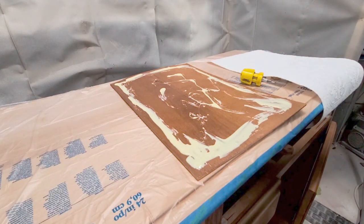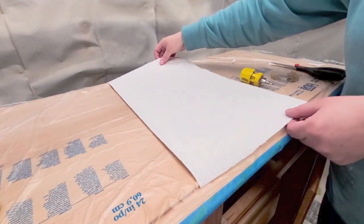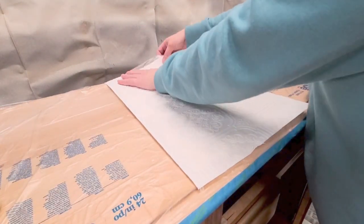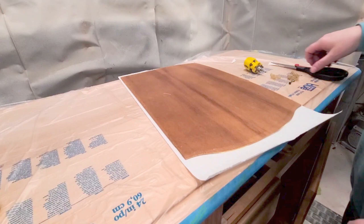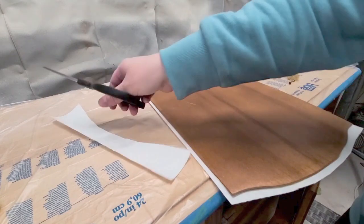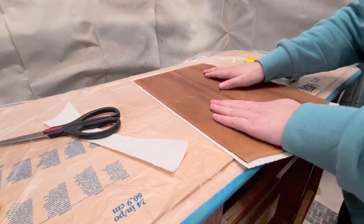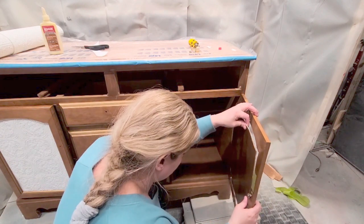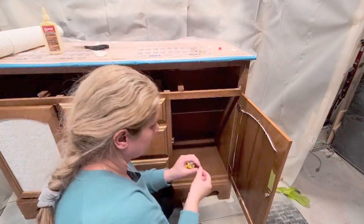The textured wallpaper I got from Lowe's — it comes in a really big roll and they have a couple of designs. You lay the paper on top of the glue and make sure it's completely smooth, then cut off any excess. If you have panels like this, keep a little bit of paper overlapping so it sticks out the back slightly. Then I placed both panels back in and put the clips on, making sure the paper stuck out a little so I could trim off any excess.